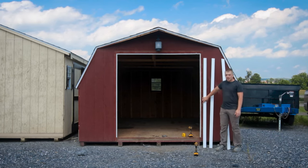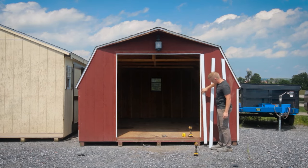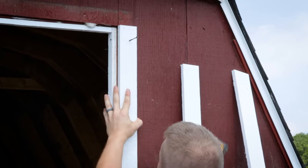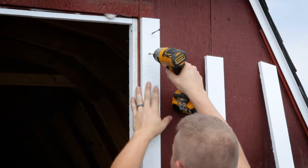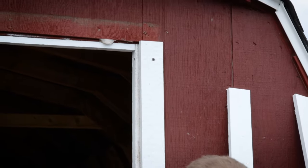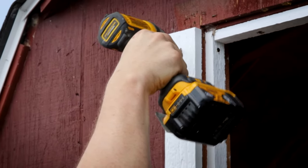We are ready to mount the outer trim that the doors actually mount to. This trim will be mounted flush on the edge of our opening, at least on the bottom. In this case, because the door is off square, we're going to keep the top in a little bit to account for that. So here I'm keeping the face trim over about 3 eighths of an inch more than we would have to, to account for the off-square. I'm also keeping the trim on the top flush with the edge of my siding. On the bottom we'll keep it flush with the edge of the opening. I'll do two screws per piece of trim here, and then I'll mount the doors just to see if they fit correctly. I need 74 inches between my mounting trim.